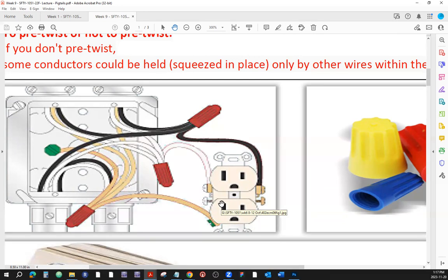And you don't see the type of connection. You don't know whether the wire is stripped just the right length, or maybe it's too short and the connector is barely grabbing the conductor, barely making connection. With the screw terminal, at least you can see things and you can see if there is any loose connection. And if you see any problems, you can still correct it because it's right in front of you.